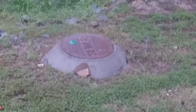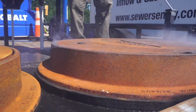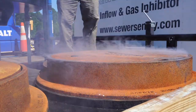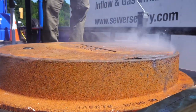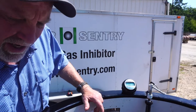Both these manholes are the same, they're brand new. One of them's equipped with a Sewer Sentry kit. It's a rubber gasket glued into the ring with that raised hole. The raised hole doesn't let the water get into the hole. It goes around the hole, not in it. So this manhole is venting, this manhole is venting also, but we're gonna show you how much water is getting into this manhole because we have the same manhole in our vat. And we're gonna show you just how much water is getting in. During rainstorms, this is gonna be a sheet of water just like you have